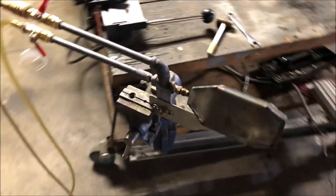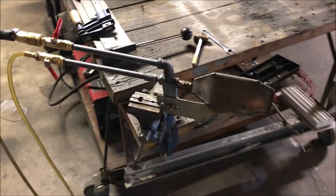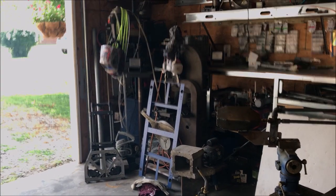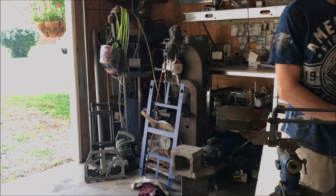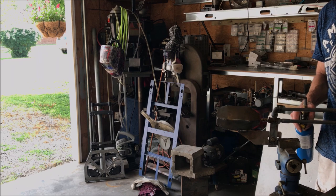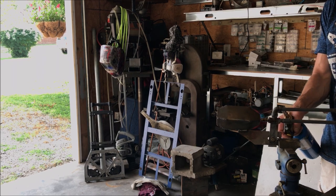Just a quick little video for Dalen - I'm going to show you how to light this thing and point out a couple of things about it. To light this thing up, the first thing you're going to want to do is open the fuel valve all the way, then give it a quick shot of air at full blast. You'll see the fuel traveling up the fuel line. When it hits the fuel pin stock, turn the air all the way off.